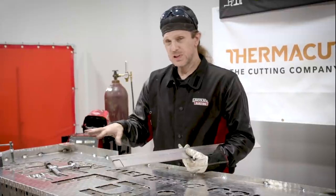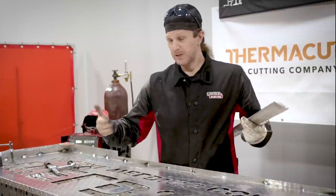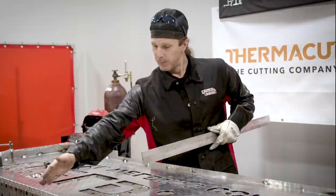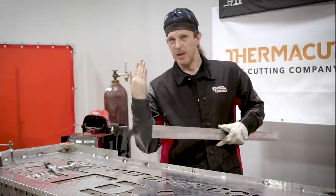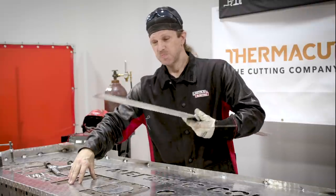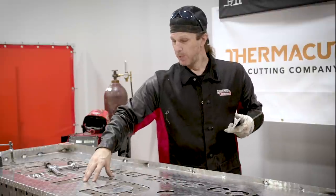The sign pushes in a little bit due to the flexibility of how thin the material is. So I'm going to take some two-by-quarter-inch aluminum and make a plate — basically an extra brace to keep everything nice and flat on the outside so it's not bowing at all. Simple — just going to tack it onto the outer framework to reinforce it and we're good to go.